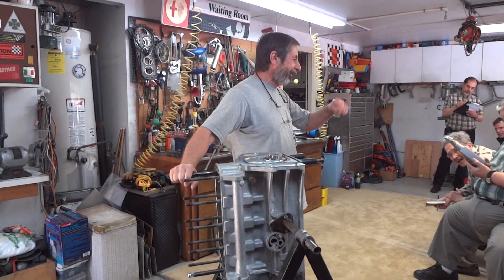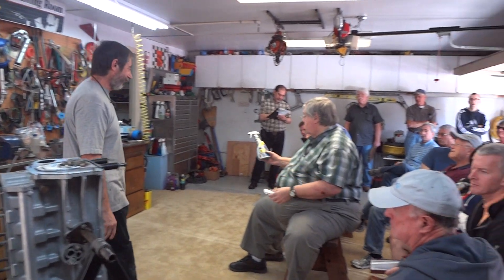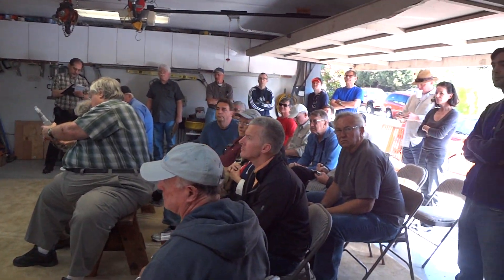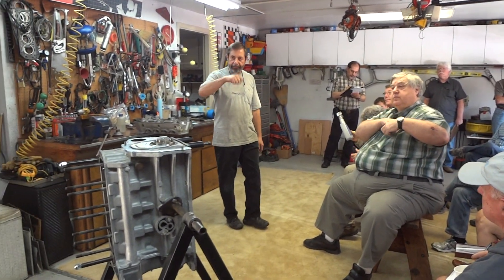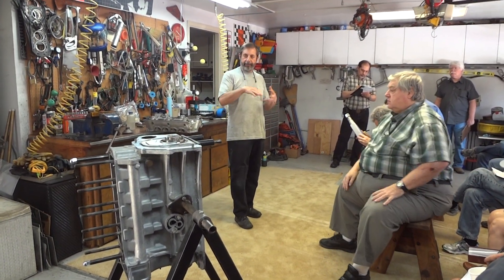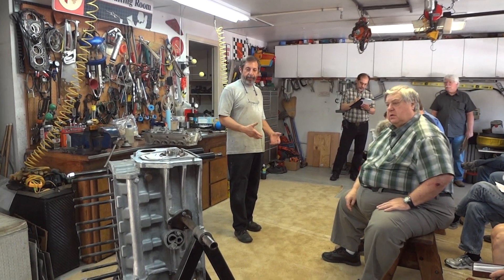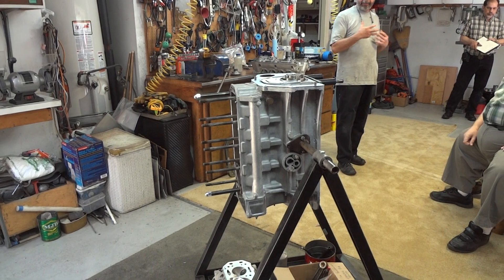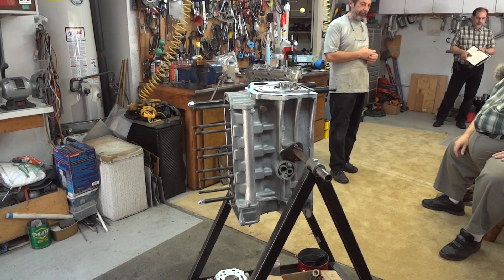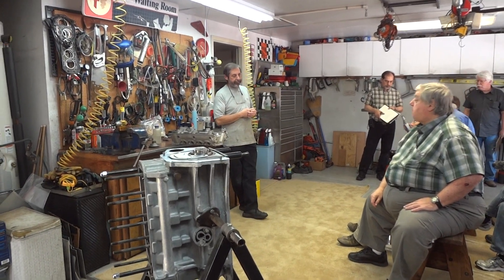It's not an instantaneous thing. Don't think you're just going to spray it on and be done with it — it's a lot of work. You can leave it on a long time. I basically leave it on, brush it around, hose it off, let it drip dry, and then do it again. You'll know when it's clean because it'll really start to foam when it finally gets to the aluminum and gets through the varnish. Then it'll start to do a light etch on the aluminum.